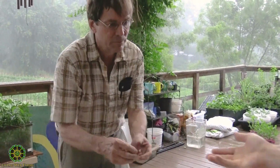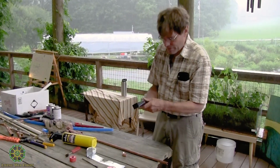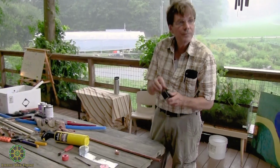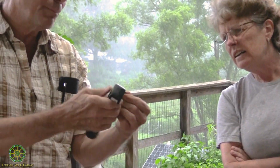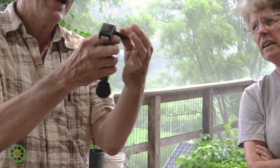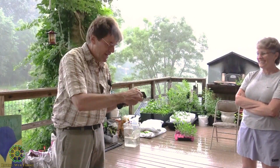Now, it wasn't difficult. Yeah, you can look at that. So the next thing we do is we take the end of the tool here. Onto this tool there's a built-in little burnishing device. It's a sharp file in a triangle that you take the inside of, yeah, you can feel it, the inside of the pipe. We do not want any burrs inside here.